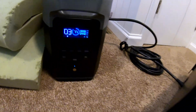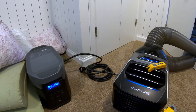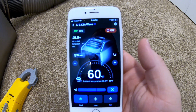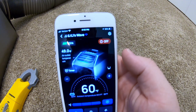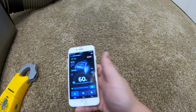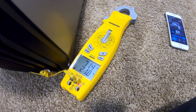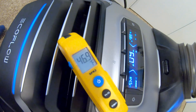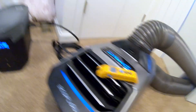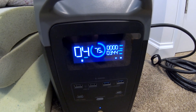On max mode we're pulling 440 watts. Switching to manual high fan speed plugged into the Delta 2 Max: the app says we're blowing out 49 degree supply air with 68.8 degree ambient air temperature. My probe shows about 71 degrees ambient at the return, and the discharge temperature reads 46.9 degrees.